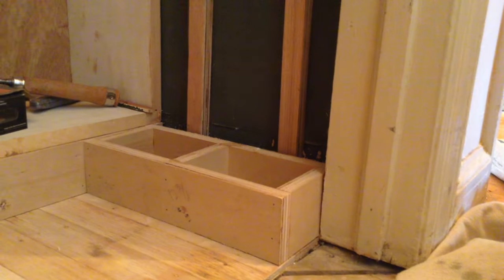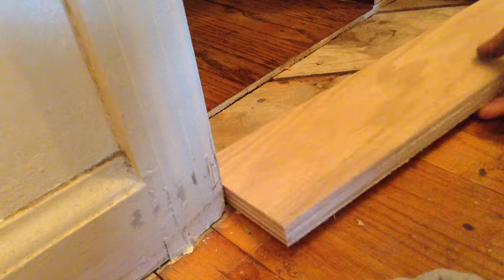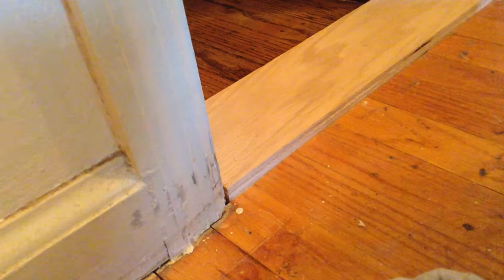You can see how off-level this is — that will be fixed before they're permanently attached. The back spacers are because I wanted these to go up to the underside of the shelf; in the original closet they had trimmed out with about one-by-threes to put the shelves, so this bypasses that and goes up to the bottom shelf, which is why I have those spacers there. Then I could stain the floor. I tried to do a remodel without completely reinventing the wheel, so I kept all that upper spacing in place even though it wasn't truly accurate.